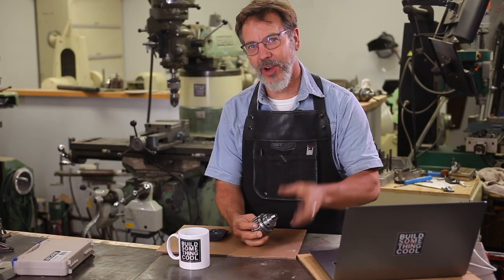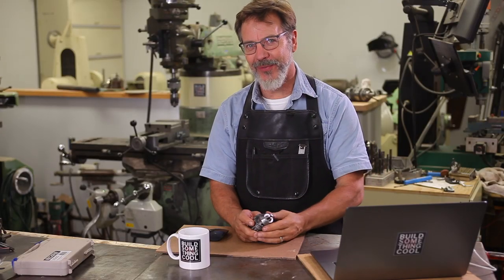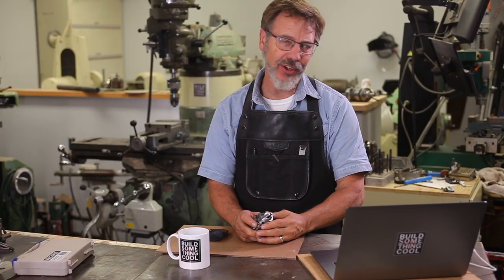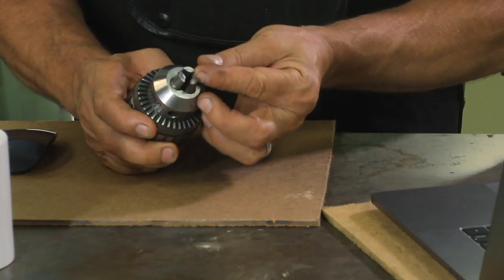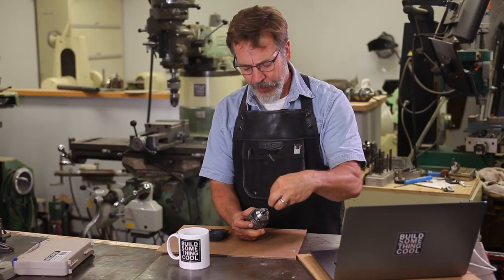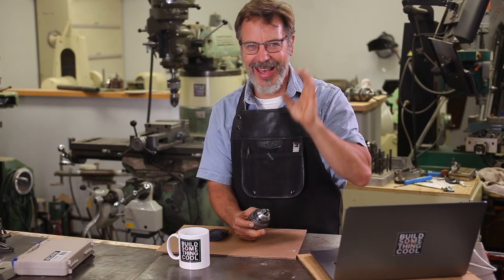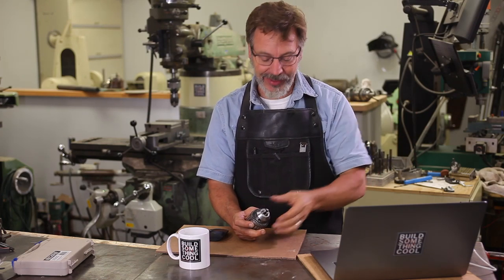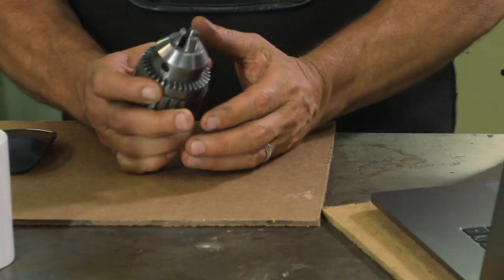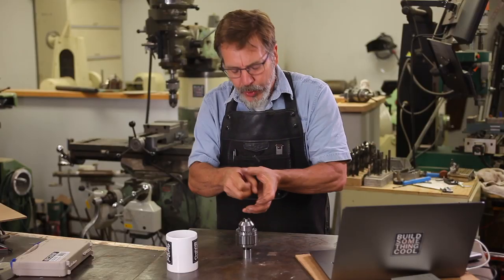Let's talk about the theory of grinding these chuck jaws in — it's going to be very unorthodox. I did some research and didn't find a lot of information. I found one guy on YouTube who actually inserted a couple pieces of metal in between each of the jaws and clamped it down, and that gave the force to hold the chuck jaws in place. What I'm going to do — and I don't say it's the right way — is I used centrifugal force. The goal is to get these chuck jaws to spin so quickly that they're forced out into position. It's kind of unorthodox but it does work.